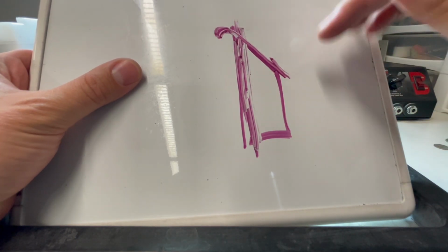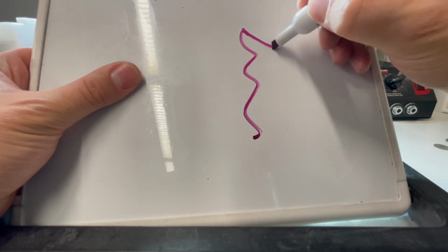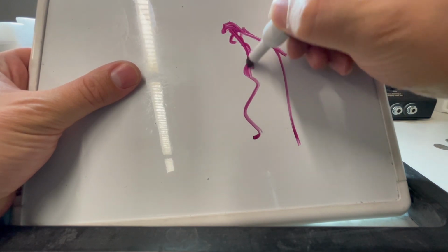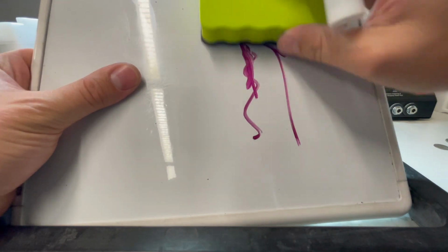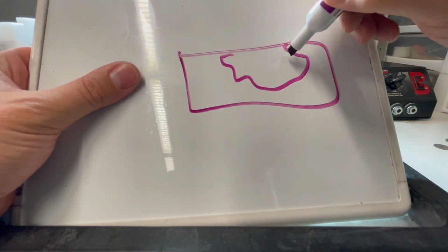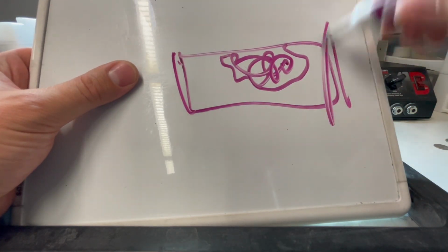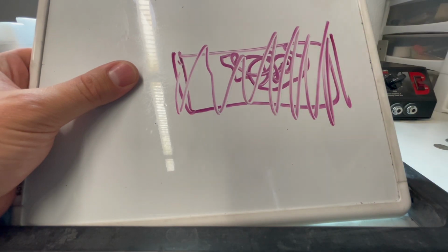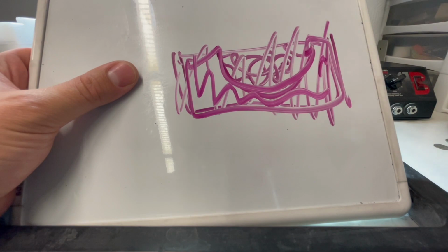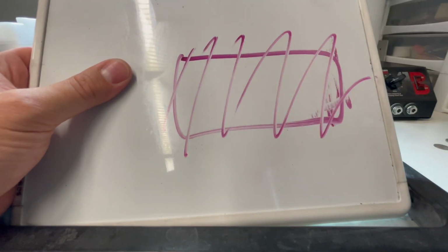If we don't have a clean edge to make a burr off of, and we try to take material, that burr is going to reflect that rough, gruff side. So our goal here is to take the knife that has this splotch in the center here and take off a layer of steel from that top angle. Basically, we need to take off all of this material around here. We need to take that down so that the edge will be nice and shiny and clean.